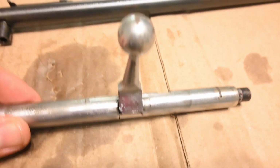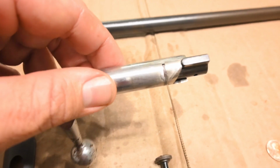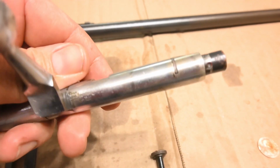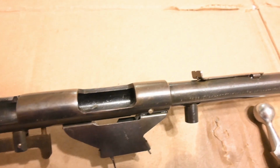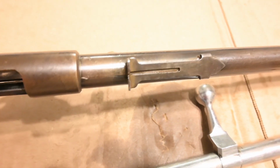Okay, we've got all our parts cleaned up. The bolt, I was getting some scratches in it, and I never was quite able to get the knob where it looked good. But on the end of the bolt here where it had rust on it, turned out much better. So we got most of that off. The barrel itself here. And so what you see, that haze is actually the copper from the scouring and the penny that is transferred to the surface.